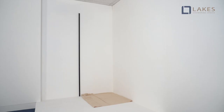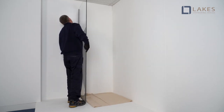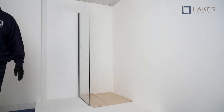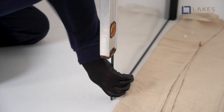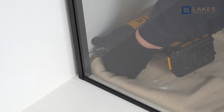For the cans panel construction, locate the panel subassembly onto wall profile and push back to the wall. Check the panel length is as desired. The panel may be pulled away from the wall if required by a maximum of 15mm. Ensure the panel is plumb and carefully drill with a 3mm bit and screw the panel to the wall profile.